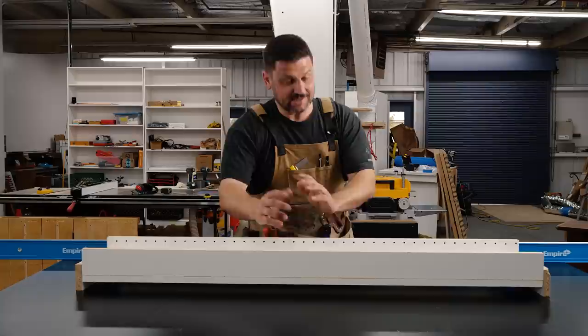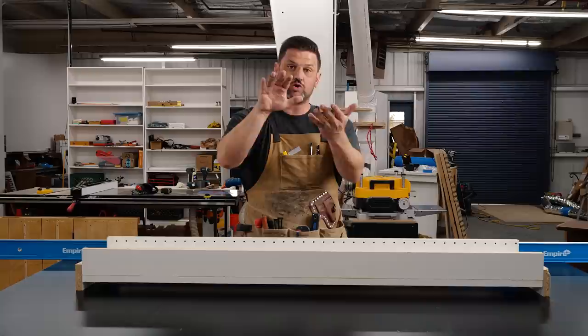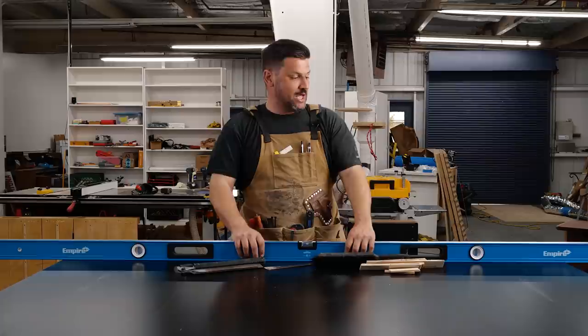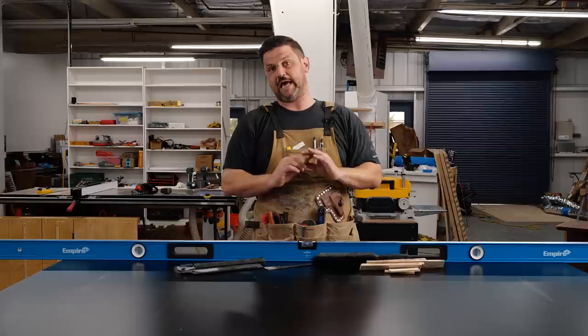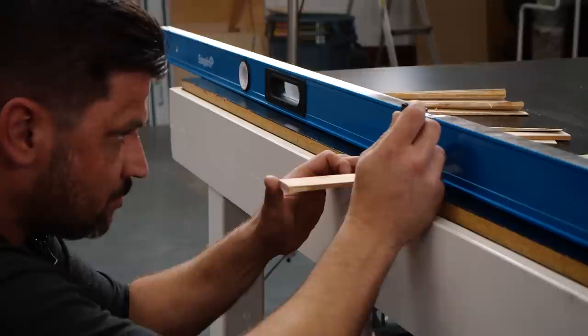Our sled is done and it's really rigid — it came out great. Glue doesn't work that well on melamine, so that's why we also put in nails and screws. Now here is the most important part: think about how a planer works — it references a flat surface. That's essentially what we're creating with a slab flattening jig. You need a good solid reference area, so it's time to make sure our table is straight and parallel. Use a long straight edge and check it on the sides, middle, ends, and diagonally.